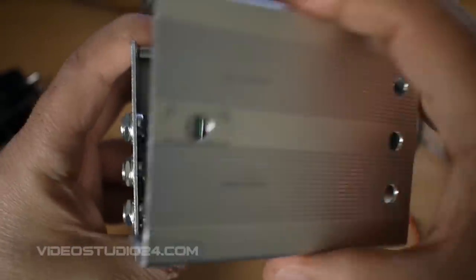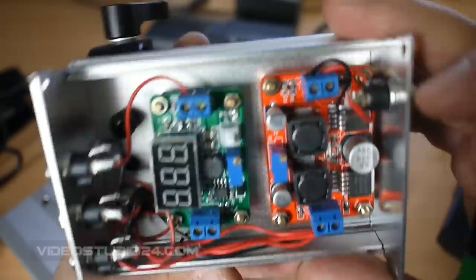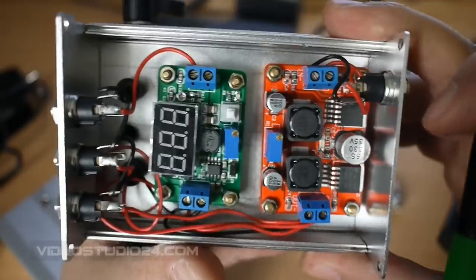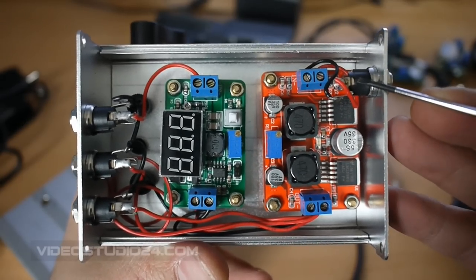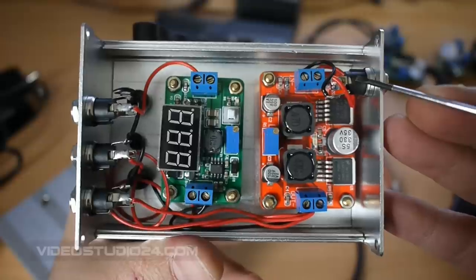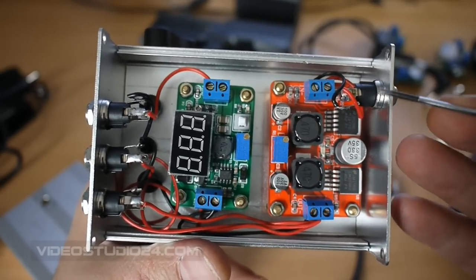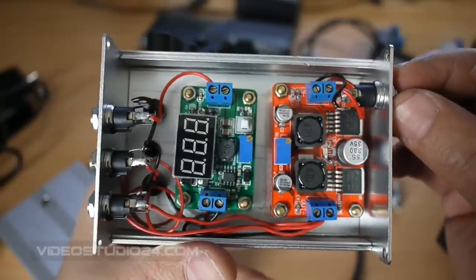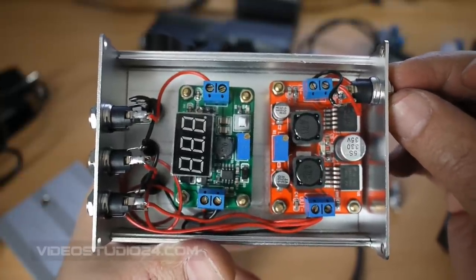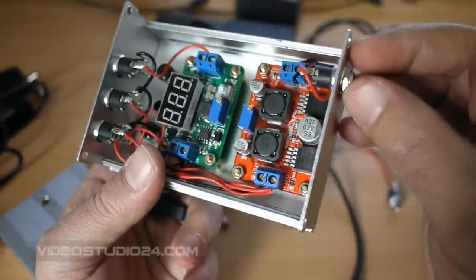This is a powering system for your DSLR. This is a simple view inside — not too much technique — here is a ready-made unit using the same basic components. My own powering system: as I said, here you get input between 3.5 up to 28 volts, minimum 2 amperes. That's very useful — you can connect here a car battery, for example.